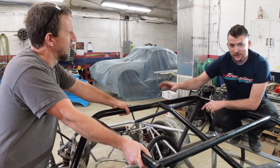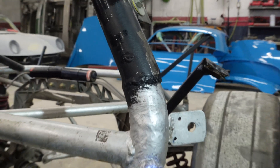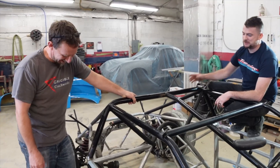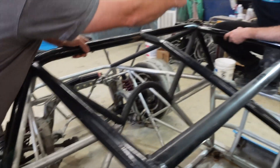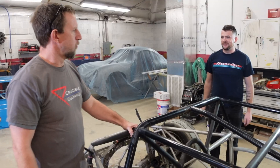The main reason we need to chop the car in half is that the main hoop has been improperly repaired. Technically it's probably safe because it has been repaired, but it needs to be one solid piece of tubing — continuous from here, up through, around, and down to the bottom. That's why we need to chop this car.